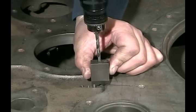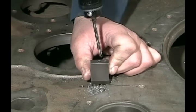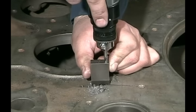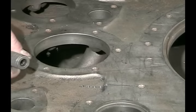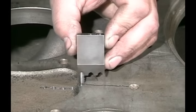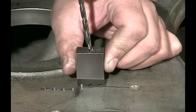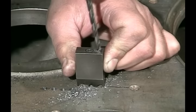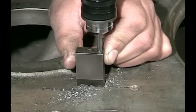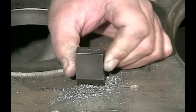You can see we're making a step up onto the machine surface right here, and the spacing jig handles that quite easily. Just continue using the spacing jig, drilling the holes up close to the bolt hole. Remember, we're going to put a thread insert in that bolt hole and it's going to get drilled bigger, so we need to leave a little bit of space between the last pin and the bolt hole so we don't cut most of that last stitching pin out.